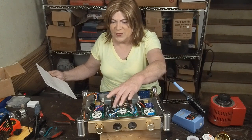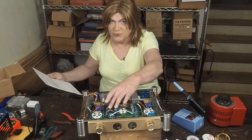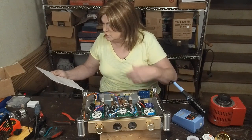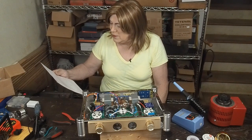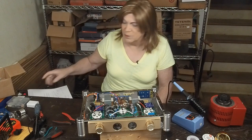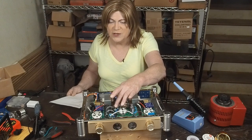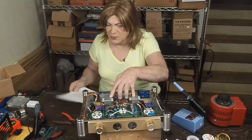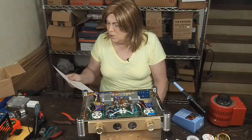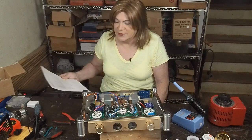With the 330 UF and these two chokes, without this 47 UF cap that I added, with or without this resistor in place, it's got 0.02 volts of ripple as it goes into the 300B tube boards. Bypassing this resistor and adding this 47 UF cap between the two chokes brings the ripple down to 0.0004 volts, which is absolutely nothing.